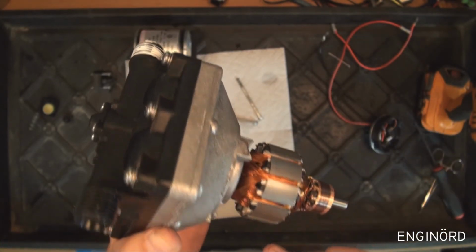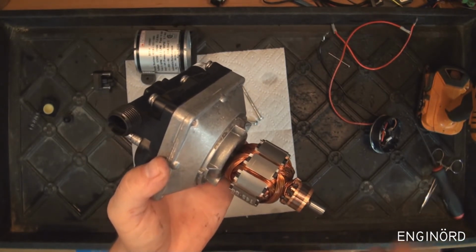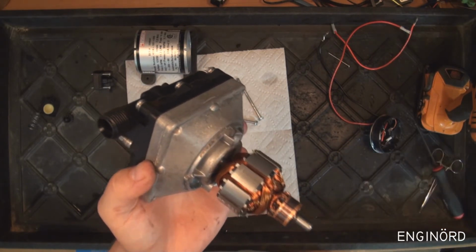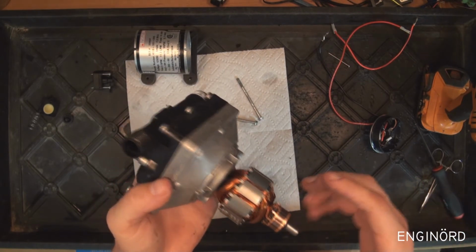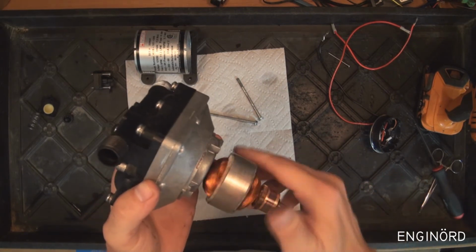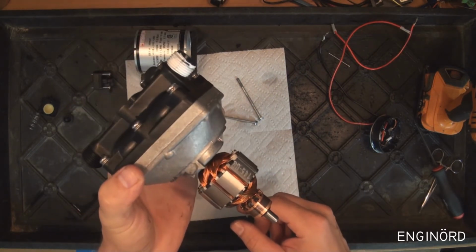So one of the reasons they use these pumps is because it's self-priming. You couldn't do this, for example, with a centrifugal pump unless you have a water reservoir above the pump that supplies water, because that centrifugal pump is just going to churn the air inside, and it doesn't have enough momentum to pick up the water and prime it. But this pump can prime itself.